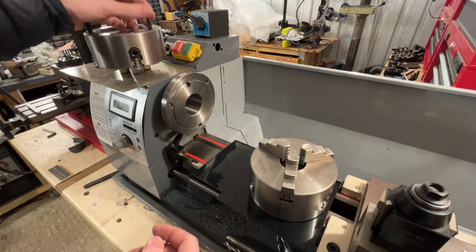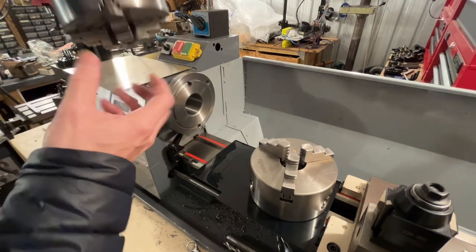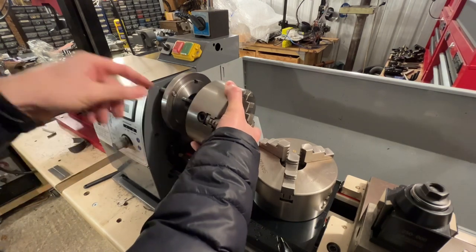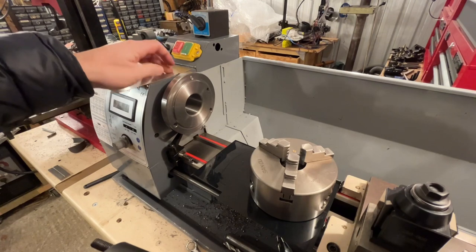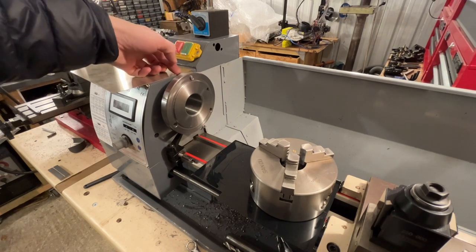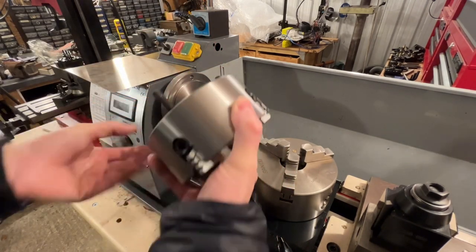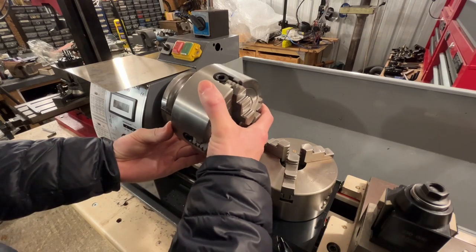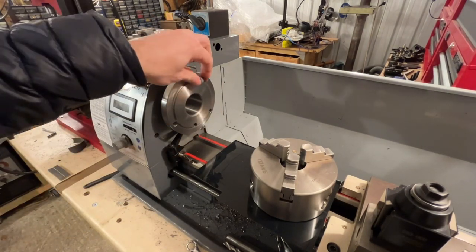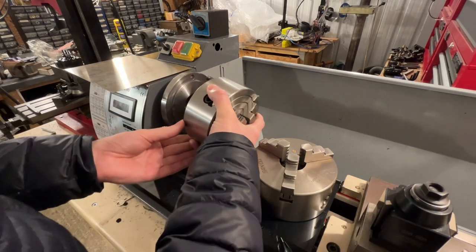What I did was put one piece of studding in the chuck, then put the pip inside one hole and the stud through the other hole. I brought it up to the top and struck it with a hammer — there's just enough space to get a hammer in. Then I took the chuck off, moved to the next hole, put the chuck back on with the stud in the same hole, and transfer punched that one too. It worked really well — the holes came out perfectly spaced.